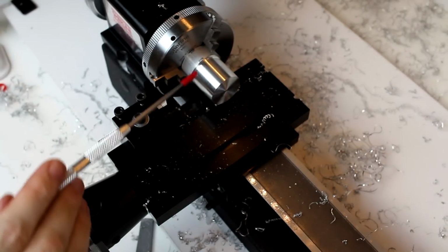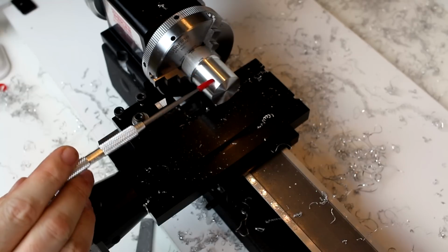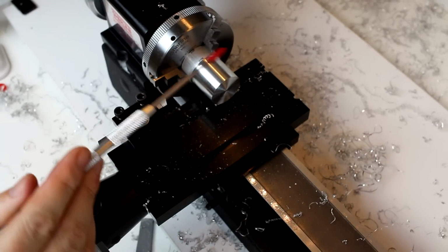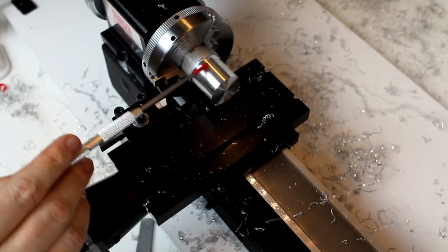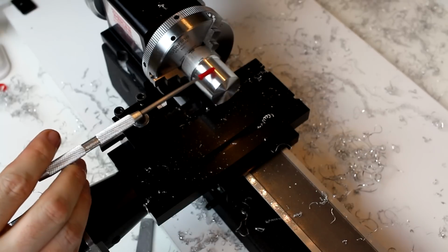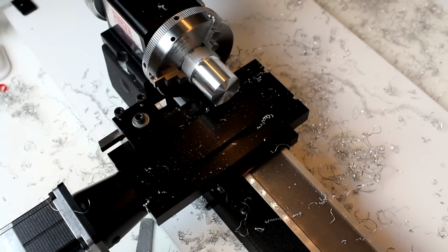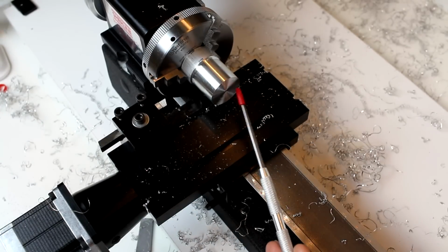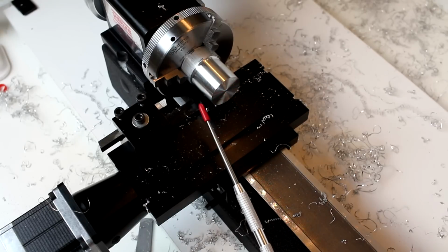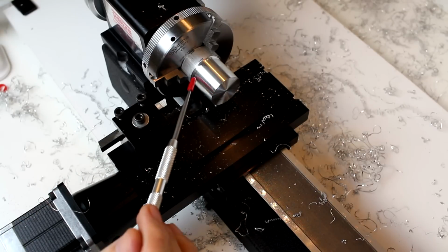Properly done, you can get this to where it's an extremely, extremely high polish and smooth finish. This is still pretty rough. We're not using any coolant, which will definitely apply, and we're not doing some optimal feed rates for fine finish, but this is pretty good for some of our first cuts. So we've covered two operations so far. First one was facing, so flattening out this edge, and we've done turning, which is running along this length.